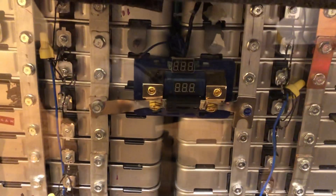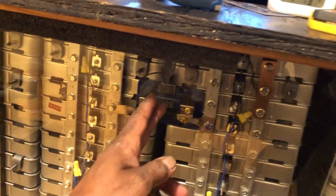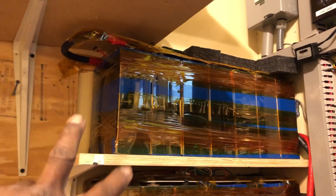There's a plexiglass across here. I've got my fuse here — there's a fuse between this bank and that bank, but I didn't put the fuse on the end of the 24-volt pack. I put the fuse on the end so that in case of anything, I can break the pack and disable the 24 volts for whatever reason. As for the blue batteries, those used to be 24 volts — as you can see, it's seven batteries wired in series, and seven in series again, so 14 batteries in series to make my 48 volts.